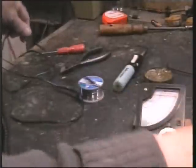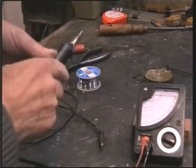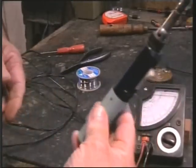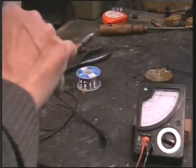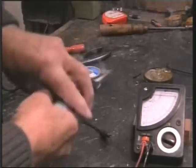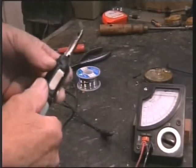I don't know what sort of soldering iron you may have — if you're not used to using one, you can use an electric one, a transformer type. But in the field these gas ones are quite handy; they use butane and they heat up a little catalytic element, and for small soldering jobs they're fine.